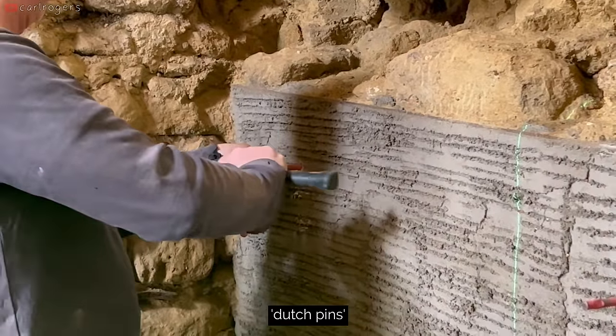Stupidly, I cut all the pockets before trying a dry fit with an off cut, and it was a little too tight, which indicated that the joists weren't all the same size. They would have been identical if the sawmill had cut them all at the same time, so I imagine instead that they put together our order with odds and ends lying about, which is a little annoying. But as the pockets were already cut, I'd have to deal with that issue later. For now, it was time to get the beam in.